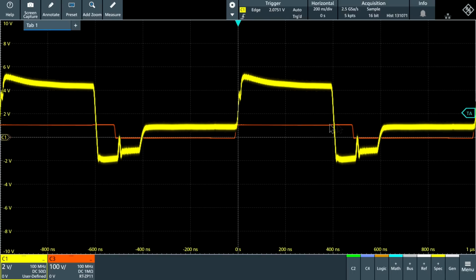Now these common mode voltages are pretty sharp at the edges, so we're basically rejecting a really broadband common mode voltage swing there, even though it's only at 50 volts, but I'm going to increase it in a second. But you can observe the intricate minor changes in the waveform of the gate to source, which is again crucial to understanding the gallium nitride behavior as it goes through various regions of operation and gets saturated and has slope limited or slew rate limited, and you can observe all of that. So let's go ahead and increase our power supply voltage and see what happens.